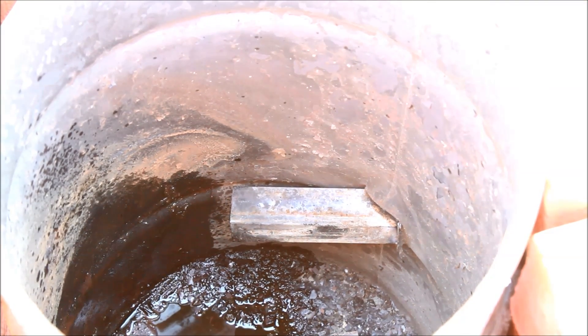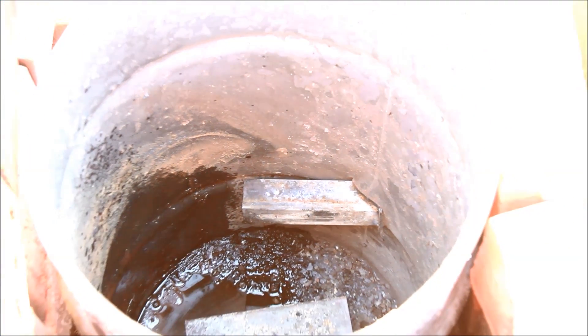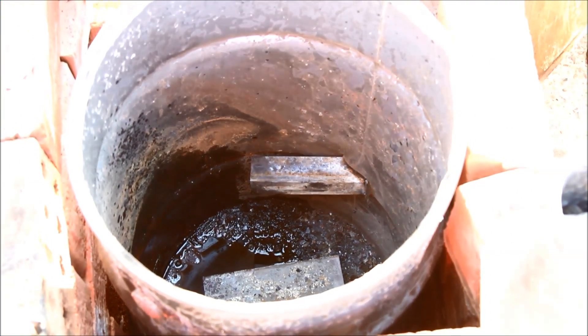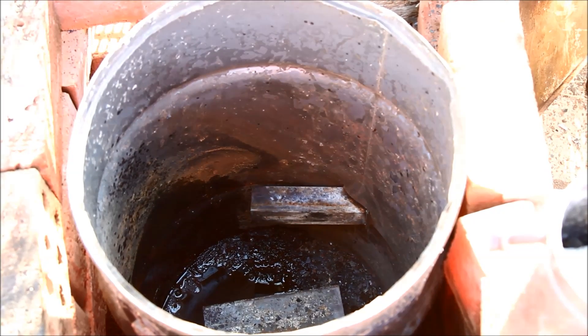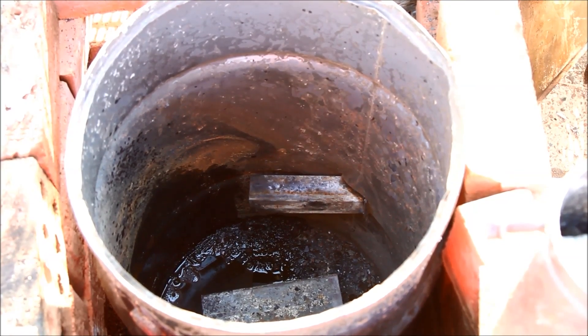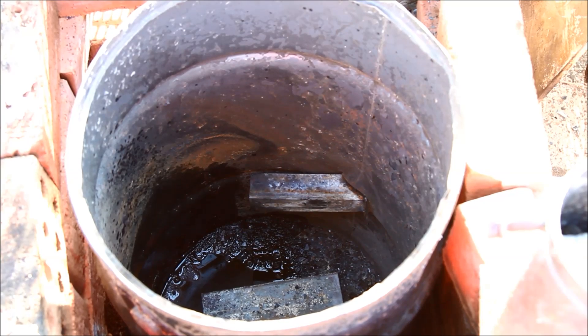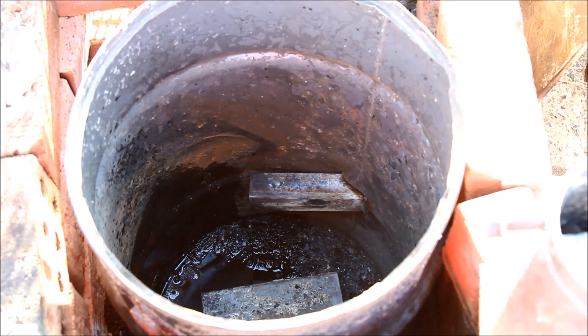As you can see, this little scrapping furnace works on the same old principle — the oil gets blown in by the air flow, and it's just a bit of metal protruding into the drum. I'll show you how easy this thing can be to fire up. It seems a lot of people are under the impression that drip burners can be difficult, but I don't find that to be the case at all. Let's see how we go.